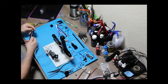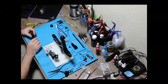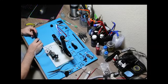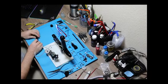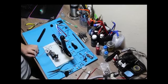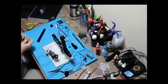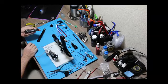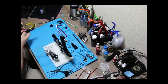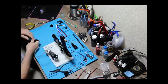So what we'll do, well, it actually sits really nice right there, is I guess I need to flip this over or put an actual O-ring on it. But it shouldn't have leaked like that. It's brand new. So let's go ahead and get the hose barb out. What I do in these situations is instead of using an easy out, because it is an odd angle, I'll grab a Torx kit and try to get it down in there and put pressure and just walk it slowly out.